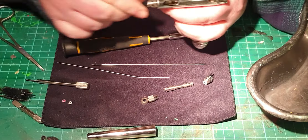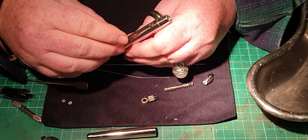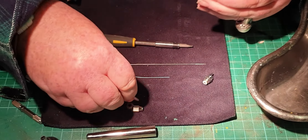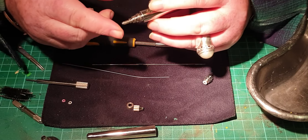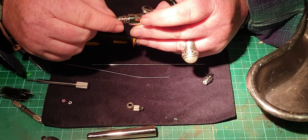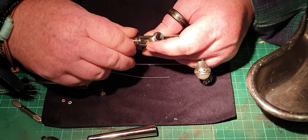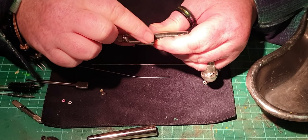Put the coupling back on. That's the trigger — it just sits on top of that button. Check that everything's in place. Then put the chuck back in, making sure everything is in alignment — look down where your trigger goes and you'll see everything click through. Make sure your spring is attached, then put your chuck nut back on. Make sure you don't cross-thread. That should snap back into position.